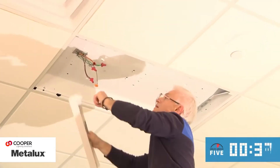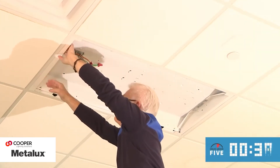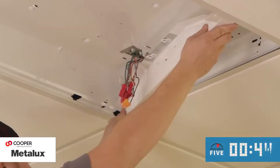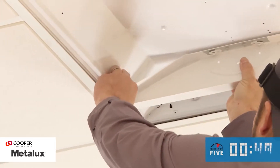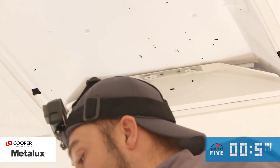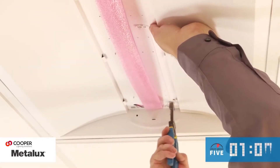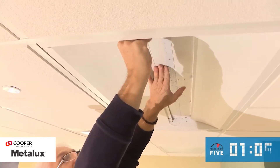It is a great design, and it looks like the design truly makes a positive impact on the speed at which the fixtures can be installed. The Cruise LED retrofit comes with five easy-to-assemble components, and the best part is you can use the existing fluorescent luminaire's housing. The first step is to install the two end plates between the grid ceiling and the existing housing — they literally snap into place! The end plates provide the structural backbone for the kit, and once both the main and side panels are slid into place, simply connect them together with just a twist of the joiner tabs.